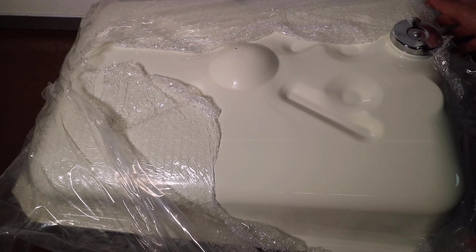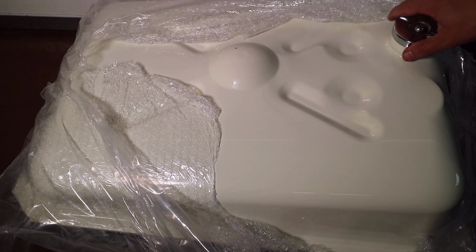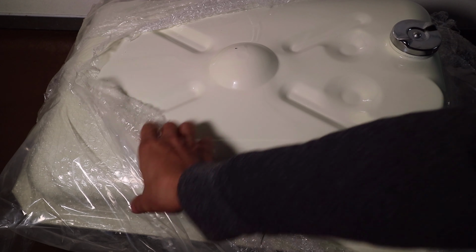I decided to purchase a new fuel tank for a couple of reasons. First was to troubleshoot and help reduce the likelihood of fuel leaks. The second was that I had seen rust and debris in the fuel bowl of the carburetor multiple times.